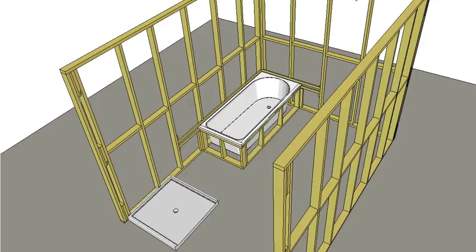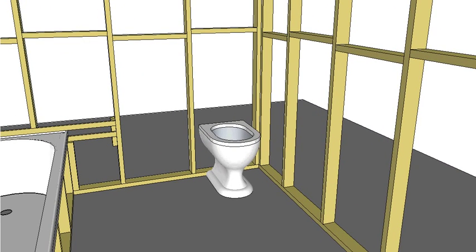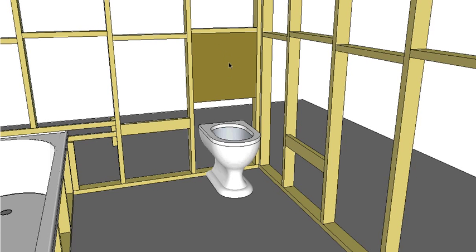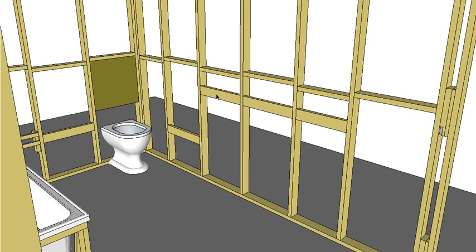So there's a few more noggins there. The other main thing you might have in the wet area is your toilet — you should put some noggins in for your toilet roll holder, whether it be to the side or slightly to the front. And of course you're going to want somewhere to mount the cistern, so similar to what we did with the shower, just put in a couple of blocks behind a sheet of ply so we've got plenty of area to screw the cistern to. Also think about where your towel rails are going to go so you can put in some blocks for those, and you might also have to think about where your vanity unit is going to be placed so you can put some blocks in to screw the vanity to — especially if you're going to use one of those floating ones, which are actually all supported by the wall.